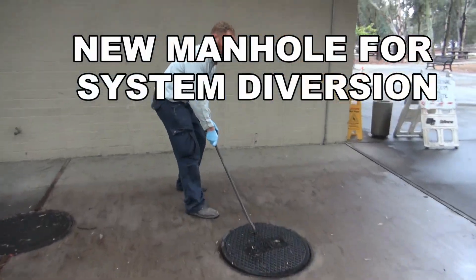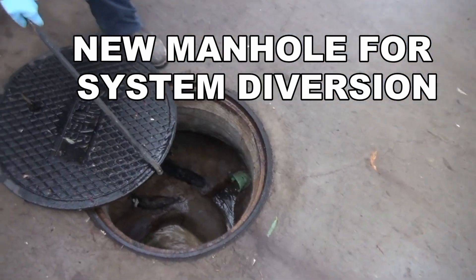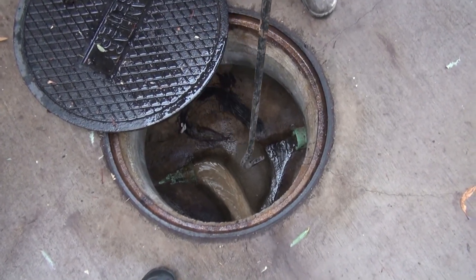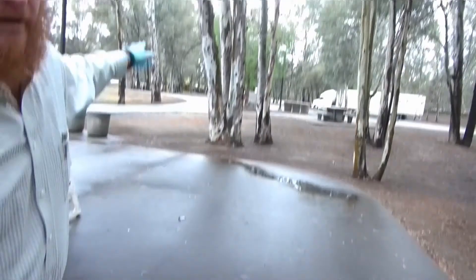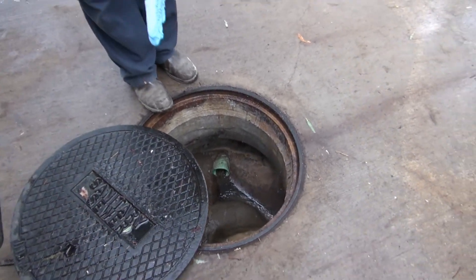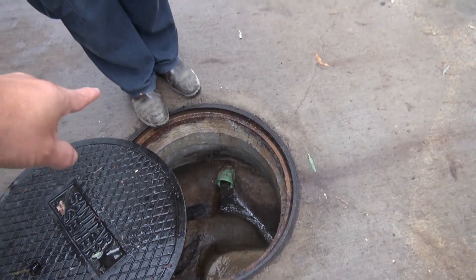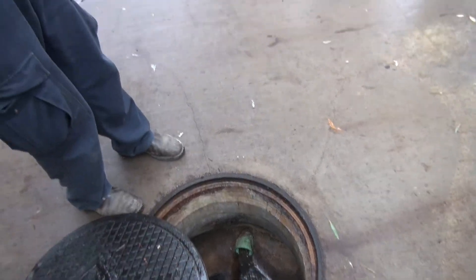So it's important. What we have is waste water coming from the building going into our lift station that diverts it out. After it gets treated, it gets pumped over into the original existing lift station — and so this is where our diversion occurs. What we did is cut the pipe that goes over to that lift station and teed into it. The green pipe is the drainage pipe that goes out to the original lift station.